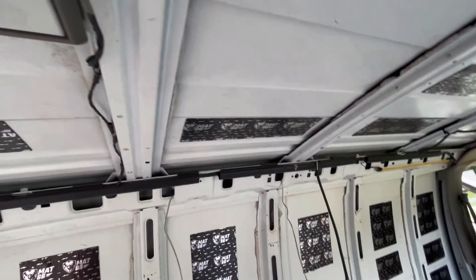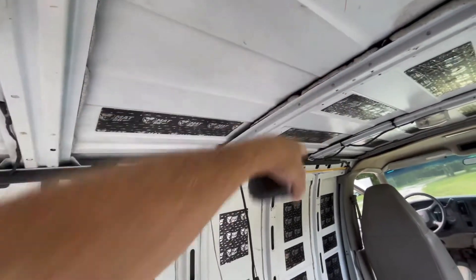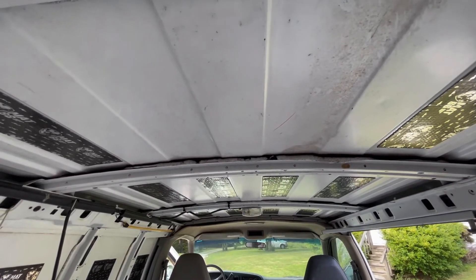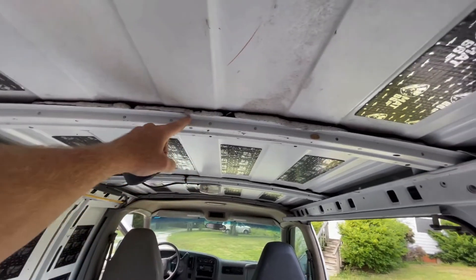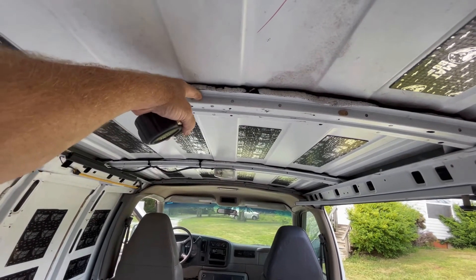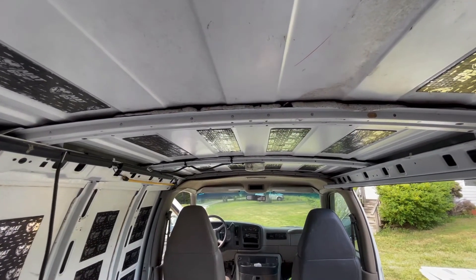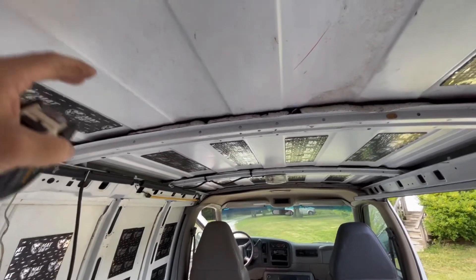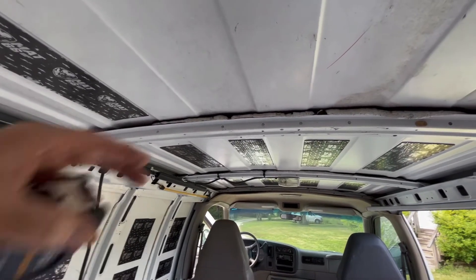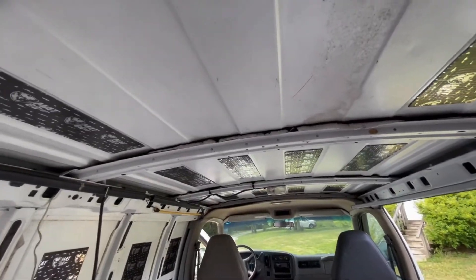What I'll do is come in with a brace here, go to 14 inches, and put whatever brace needs to be there. Measuring up what size wood — from here down is three-quarters of an inch and from this to right there is approximately a half inch, so we're probably going to make the wood about an inch thick. The key is to have the bracing around the outside of the 14 by 14 vent the same thickness as the ceiling bracing.